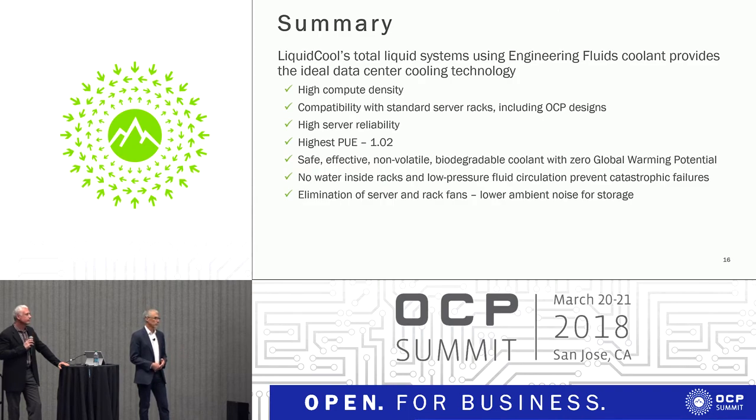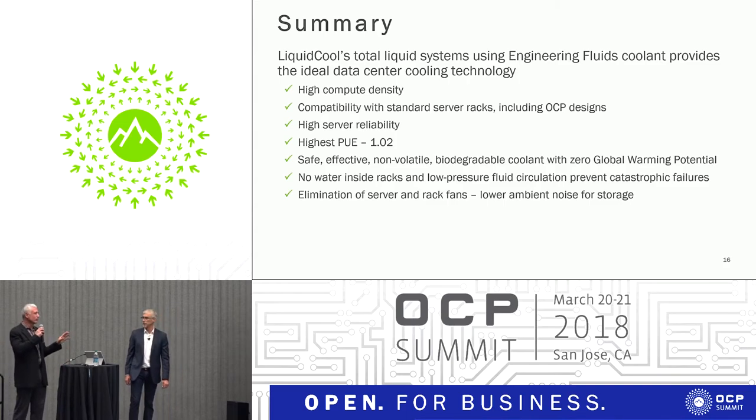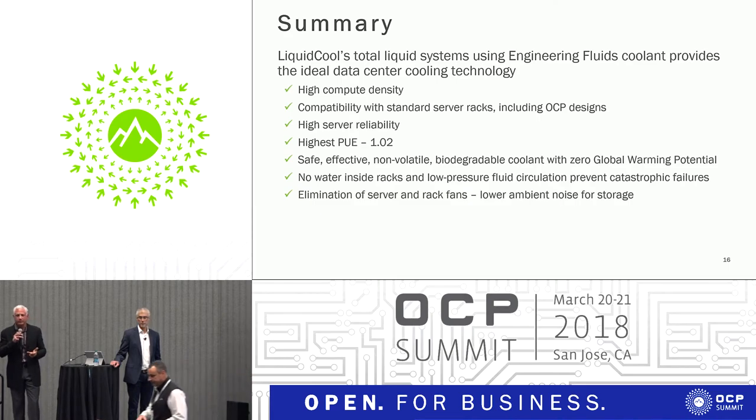On whether we provide the CDU — no, there's no reason to reinvent the wheel. The best part about single-phase immersion cooling is that the hydraulics industry has spent the last 100 years cost-optimizing just about everything related to what we do — whether it's connectors, hydraulic hoses, pumps, or CDUs. The only thing we recommend if you're going to use an off-the-shelf CDU or dry cooler is to spec in Viton seals. They're very compatible with our fluid and they last a long time and are resilient under maintenance.